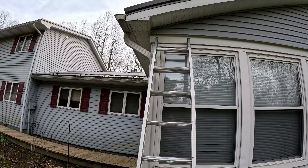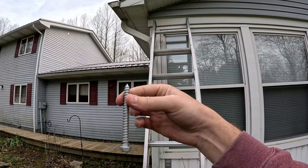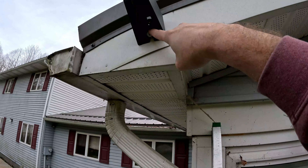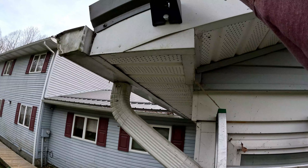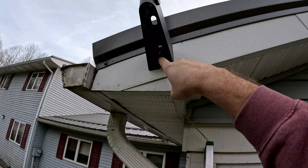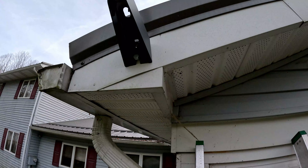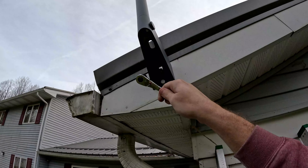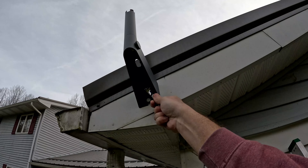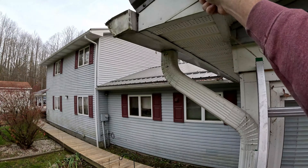I got the SpaceX silicone and I'm going to put silicone in the holes. Thread these two lag bolts in — they're pretty long, probably four-inch lags. Get one bolt in most of the way but don't tighten it; the bracket sits down on it, then you tighten the upper one up. You just want to run them in until there's a little gap — don't run them all the way in tight until you've got them both in. The app shows you how to install all the different mounts you can purchase — great three-minute videos.